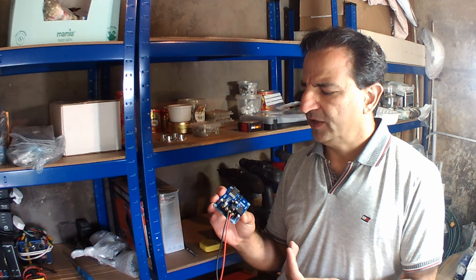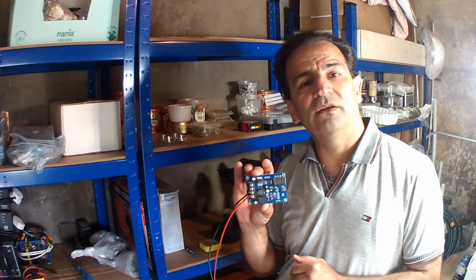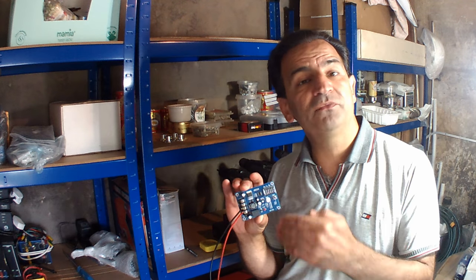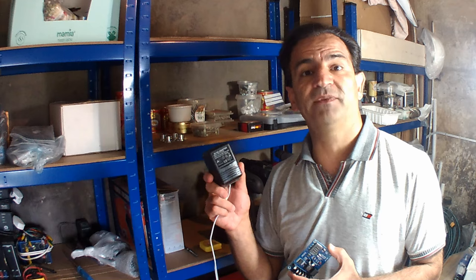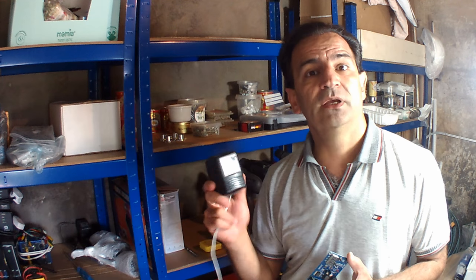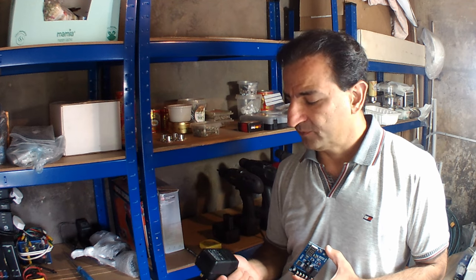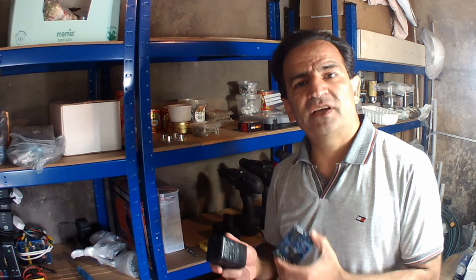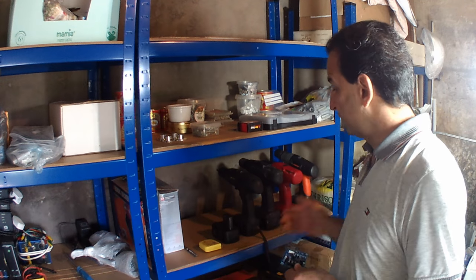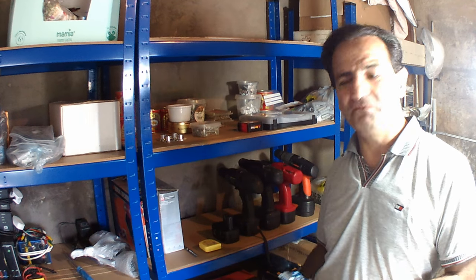As I'll explain when I show you how to wire it up, this regulator module can take from 10 to 30 volts input — that's why you can choose your AC-to-DC adapter anywhere in that range. I provide links to versatile adapters where you can actually select the voltage. As you can see, I've charged all these batteries and they are operational, even without a dedicated charger for each.